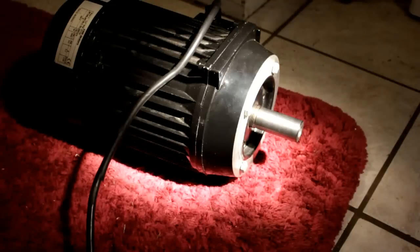Now, the issues that come up with this — and I didn't mention this in my previous videos — are mainly due to the bearings and the rotor balance. At high speeds, the bearings are really challenged because of lubrication and heat and things like that. And the rotor needs to be balanced pretty well, because if not, the vibrations can get pretty severe. If you look closely at some of the cutaways of electric cars, you can see that some high speed motors actually have oil-cooled ball bearings, which is pretty cool. There are also ceramic bearings that can be bought and fitted to standard industrial motors.